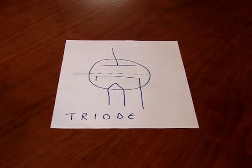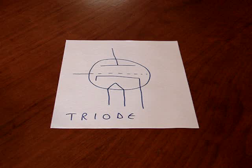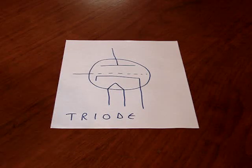If you have a tube amplifier where the metal part of the tube is glowing cherry red, turn it off. You risk serious damage to the transformers, which are expensive to replace, and you could have any one of several other problems with the amplifier. And 9 times out of 10, it will not sound right if the tube is glowing cherry red. There's too much current flowing, so turn it off. That's just some advice. Get it serviced. Usually it's a capacitor or something that needs looking into, possibly a resistor. It's not serious. If you continue to run it, you risk damaging something that's very expensive.